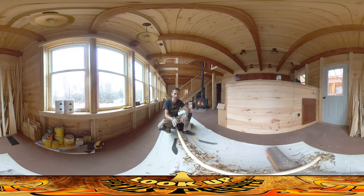One of them is working on this handrail. I already got one of the handrails debarked and it's out in the greenhouse drying. The greenhouse is a really ideal place for it to dry because it's not super hot and not super dry in there right now. You want these things to dry slowly because you don't want the outside surface to get too dry when the inside still has moisture. If you dry the outside too fast, things are going to shrink and crack - like mud outside that cracks on the surface because the top dries and shrinks while the bottom is still wet. So I'm drying them slowly out in the greenhouse.